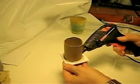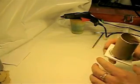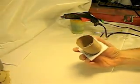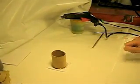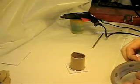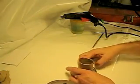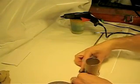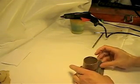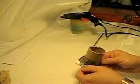I think I see one small spot here. We're going to let this dry for a second, get off our little spider webs there, and then we'll put some duct tape on the outside of it. But you'll see it's just a very simple mold here. They're just glued in place right there, and that's it. Let's pour the silicone right in, make a one part mold. You got all the little spider webs coming out of here. Okay, a little bit of duct tape on the outside. Nothing fancy, just precautionary. And that's it. This is ready to be poured.